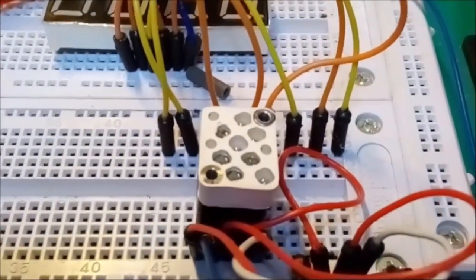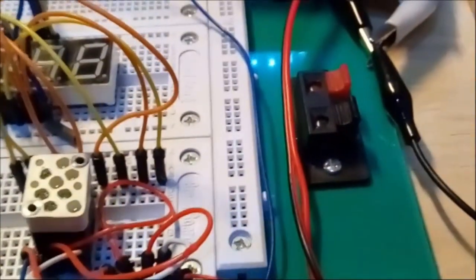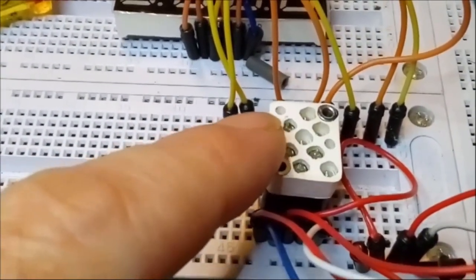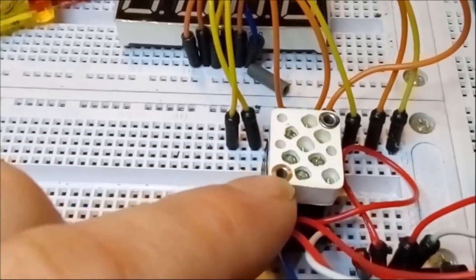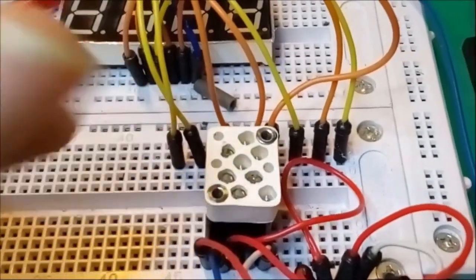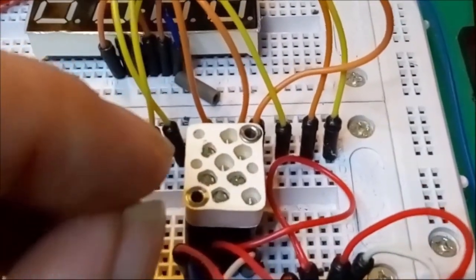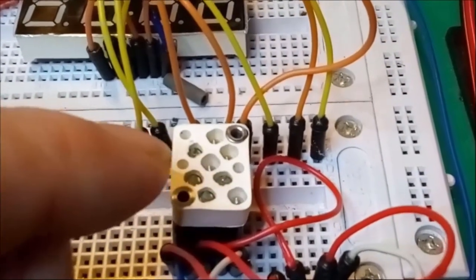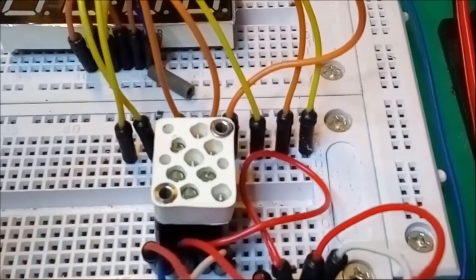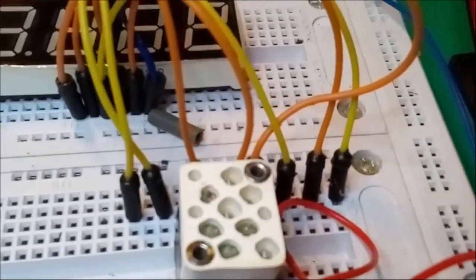Okay, I mounted the rubber holder back onto the tiny little light bulbs and I preheated it a little bit with a heat gun. Okay, so not a lot, but just enough to make the rubber quite malleable and quite flexible. Okay, so that when I squeeze it over the little light bulbs, the amount of friction and pressure it puts on the little light bulbs is reduced. Because, well, as you all know by now, it's really very fragile. But let's see if I did a good job of it, and let's see whether it works now.